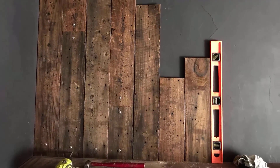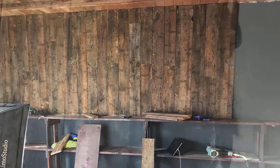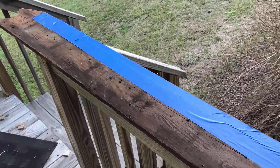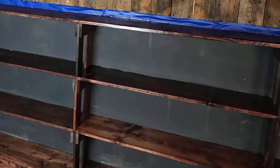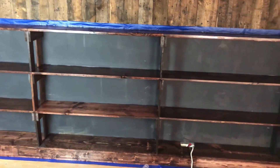This is an older house, so the walls weren't necessarily plumb. So I had to be sure that my planks were straight up and down with a level as I was going across, and I was just using those anchors to put them in the wall as well. I like the look of that because it looks like they're large studs keeping them in the wall, which they are. I had this wedge-shaped piece at the end, so I had to make a template out of some blue masking tape to cut the right-shaped piece at the end of the wall. Now I'm starting to clean up, and this is also when I put the polyurethane on the lower shelves. I didn't have to do any board prep to the planks at the top — I did wash them, but otherwise they are just how they came off the roof of that house, with all those neat nail marks and character. It looks great.